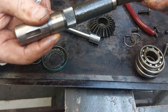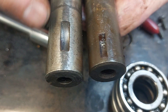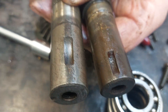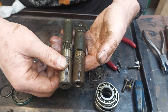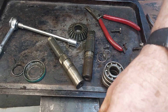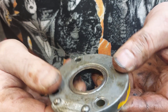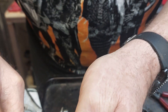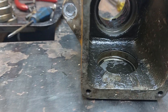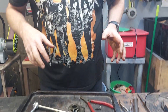The cogs are the same so it doesn't matter which way they go in, but the two shafts are different - one is the input and one is the output. I'm going to machine grooves in here and put keyways in so I can fit my SKF pulleys and run keyways on them. So that's completely in pieces now. I'll clean everything up, get some new seals - the existing seal is pretty knackered. I'll get new seals for both input and output, machine up these pieces, and then we'll reassemble. The reassembly will be in the next video - Peerless gearbox 101.